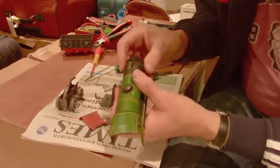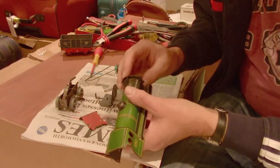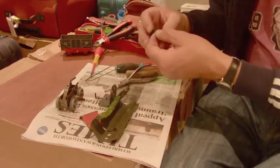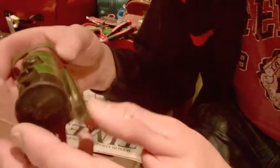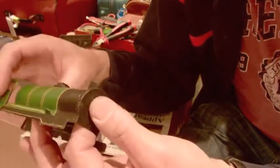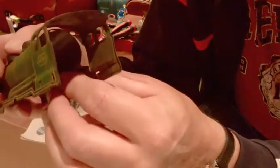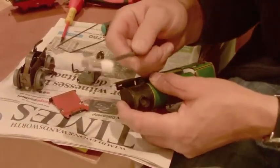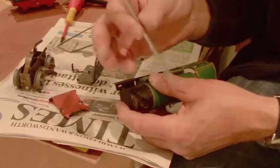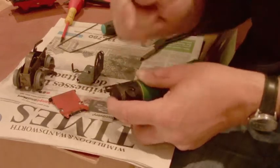With the tape inside the pliers we can get this to be nearly exactly the way it was. I quite like that — the chimney has to be straightened a bit more but it is beginning to look up. This tab is denting so I've got to straighten it a little. Look at how much we've already improved that within five or ten minutes with no big song and dance and just one pair of pliers. I got this little watchmaker's kit in Béziers, France for six euros and the nylon-faced tool is coming in very handy for tapping things in.